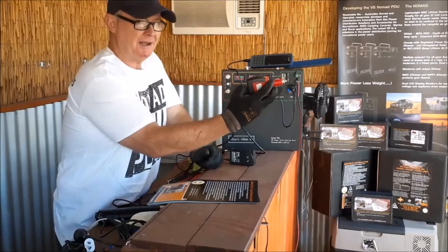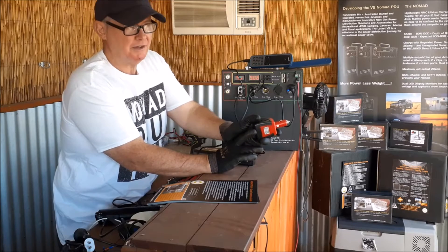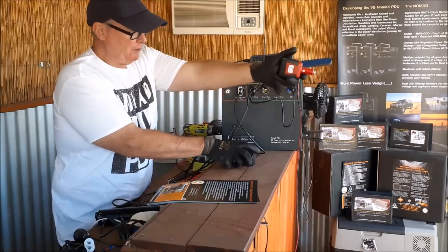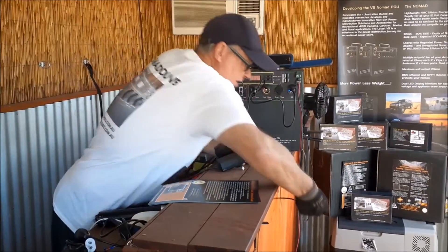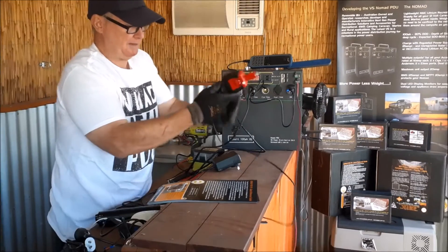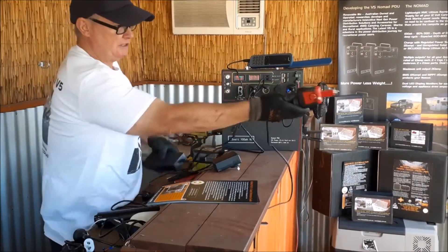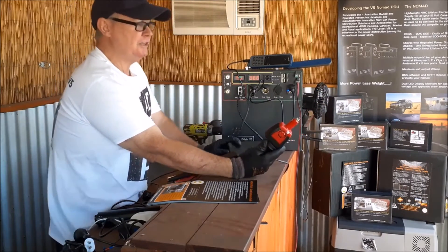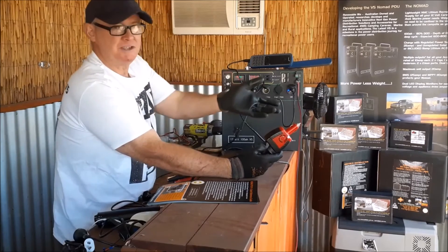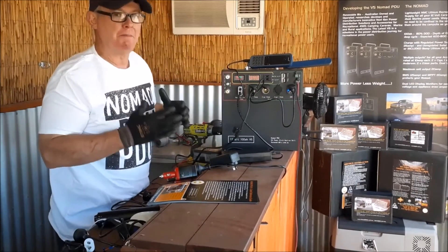When we talk about charging the unit, you can plug the pocket inverter into your car — your car should be rated for 12 volt and 10 amp minimum, because it will pull 150 watts. You plug it into your car and now you basically have a 240 volt connection. Don't plug in anything high-wattage or you may melt the car wiring. You can then take your AC-DC 8 amp charger, plug it into the inverter, and charge the Nomad. It's not a permanent solution, but great for a couple of hours between solar blanket sessions.